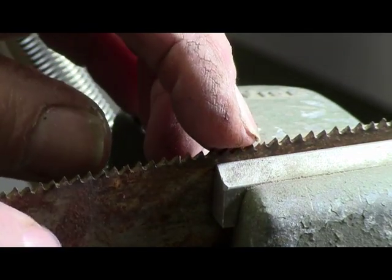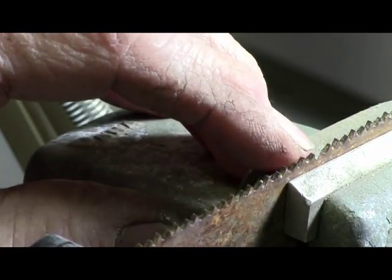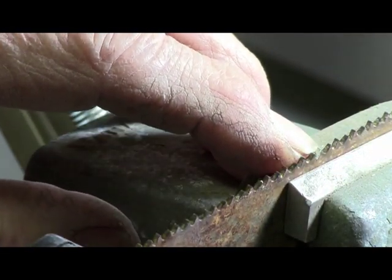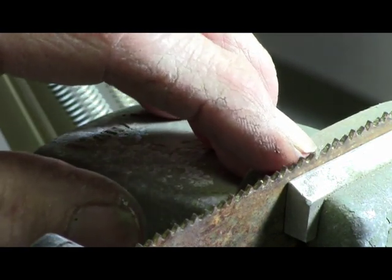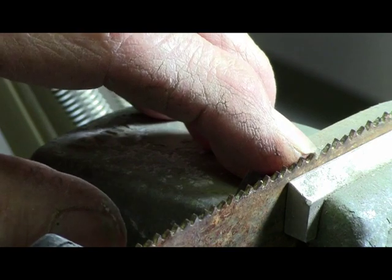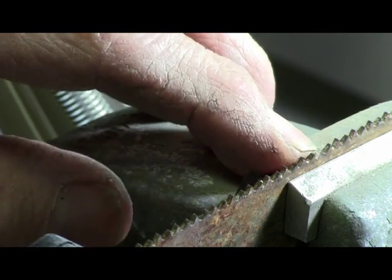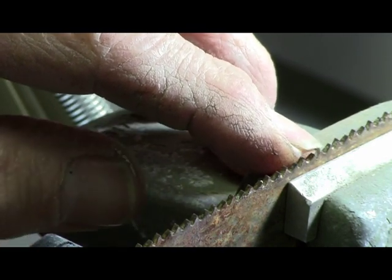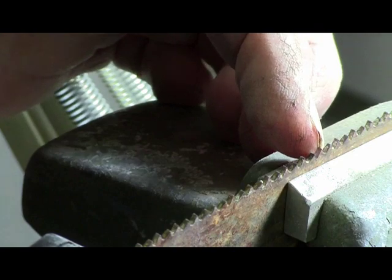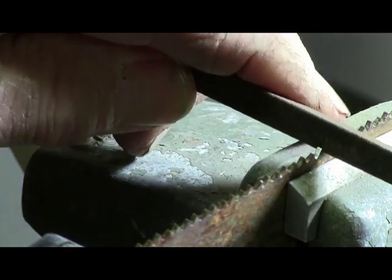I don't know if you can see this very well or not. I'm hoping you can. But you can see the back side of the next tooth is all shiny, so you know you've got a good point at the top, which means this one has been sharpened. But then when you get to the next one, you'll do the same thing, but now you'll be doing the front side of it,